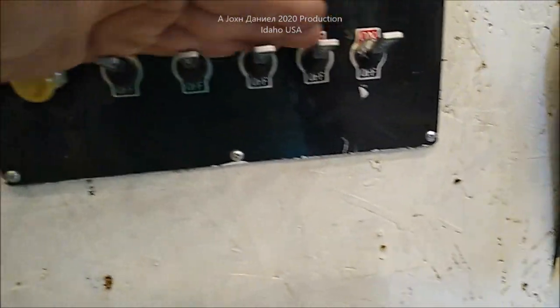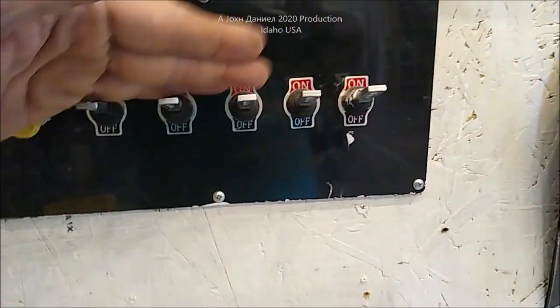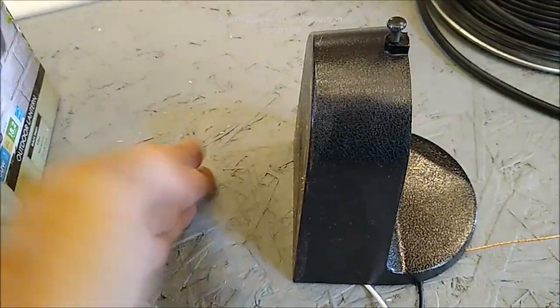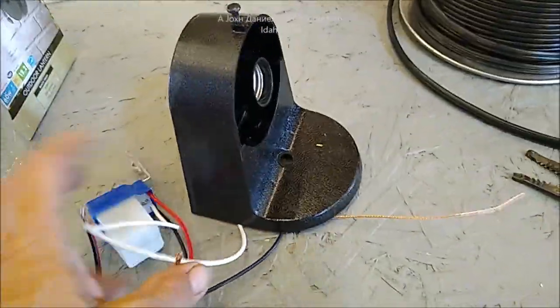For those who watched the other video — it's still sitting here, I blew a hole through that to prove a point. Same function as these lights for my 12-volt setup: one controller turns on the upstairs light, and the others control all the lights in the shop. Now, you must mount the dusk-to-dawn unit no less than two inches above the center of the light fixture so the light doesn't false-activate the sensor.